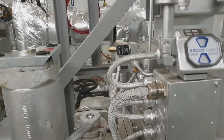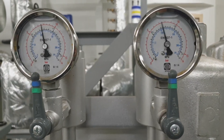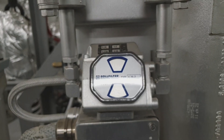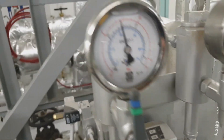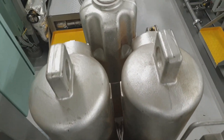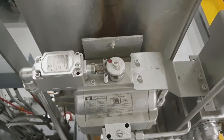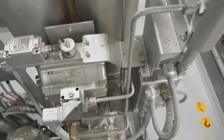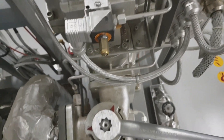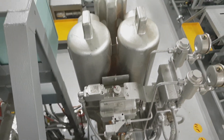Welcome back to my channel. For today's video we will talk about what is an auto backwash filter. This is the main engine fuel oil auto backwash filter. The purpose of this is to filter particles from media or heavy fuel oil in order to protect the downstream parts of the plant and to ensure that the fuel is clean enough before feeding into the engine. The filter candles are cleaned automatically so that the plant does not have to be switched off for cleaning.